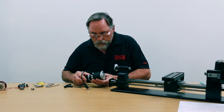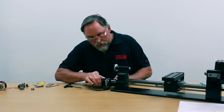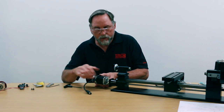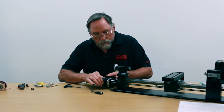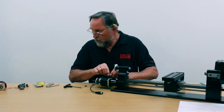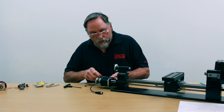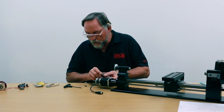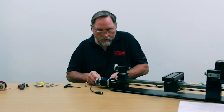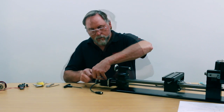Turn your hand wheel so that the flat is facing the set screw. Make sure the mating surfaces are clean. I also mount this with the cord coming out of the side, not out of the bottom. Put the stepper motor in — we have four 8-32 screws. Get all four of these started first; don't lock them down one at a time, just get them all threaded in nice with no cross-threading.